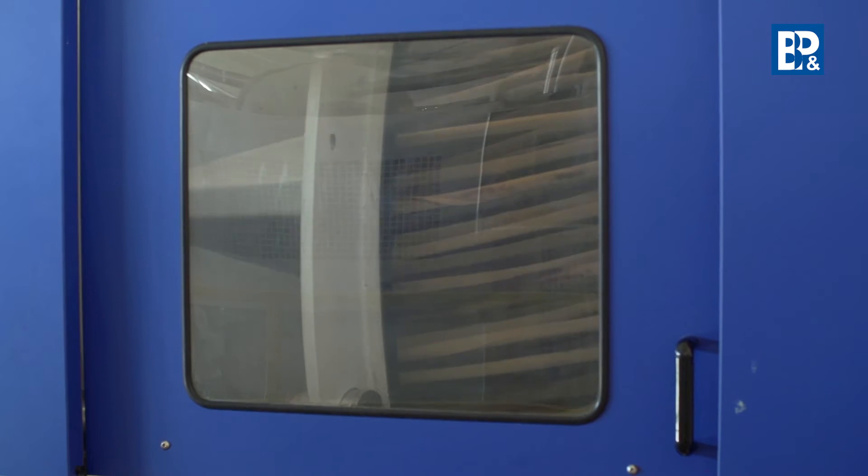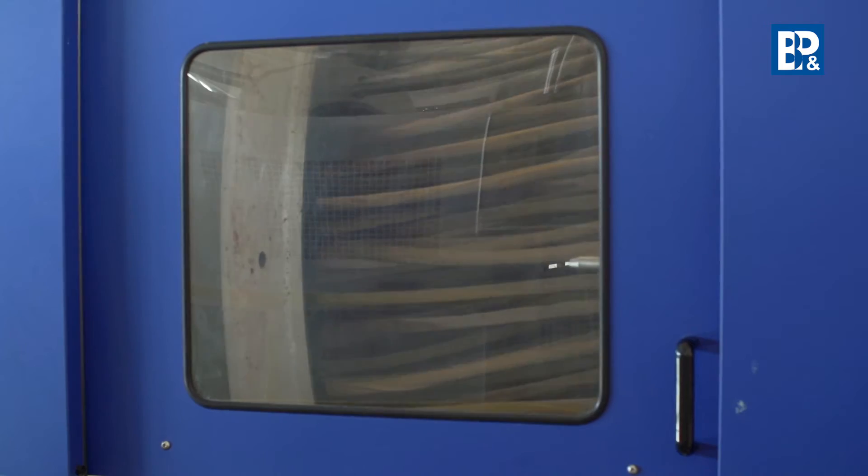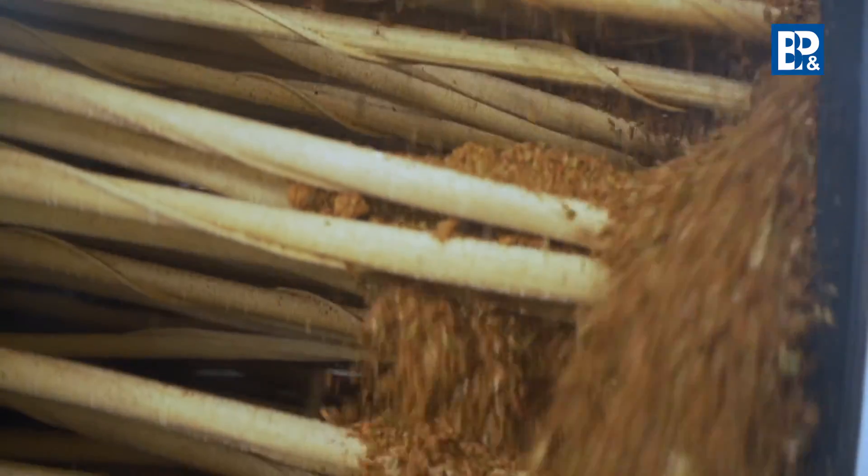This phase is repeated in cycles and each piston feed is a few millimeters longer than the previous one. Constant cylinder rotation during the pressing cycles as well as expanding ensures the most advantageous loosening of the pulp pressed, which thus guarantees the maximum pressing efficiency.